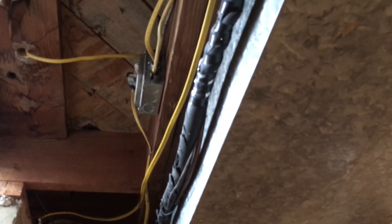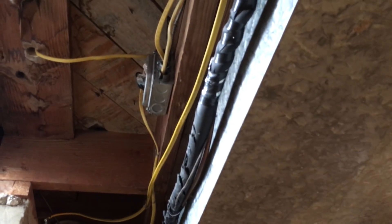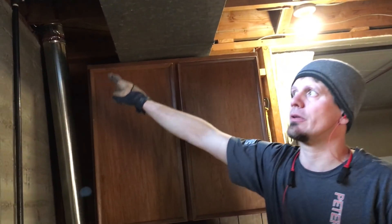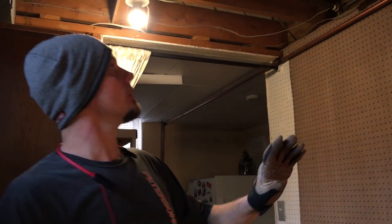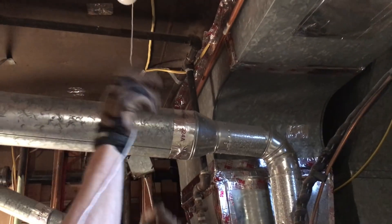That was dedicated — I pulled that out when I did the fridge. Up here somebody already did a box years ago, probably five years back. I went ahead and traced that out and joined it — basically there's a back outlet out there that is now part of the dishwasher circuit. It's not going to hurt anything whatsoever.